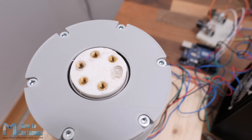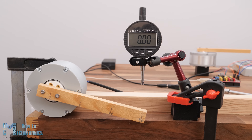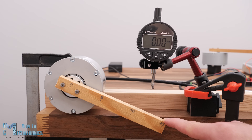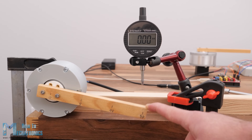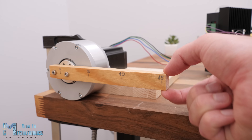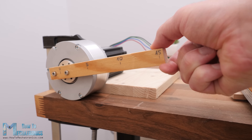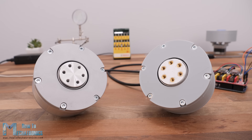I also did accuracy tests. Repeatability was good for both versions. However, once a load is applied, both drives show some backlash. The CNC machined version showed around 4 mm of play at a distance of 12 cm when force is applied in both directions, while the 3D printed version showed 7 mm of play at 15 cm. The backlash is present because the bushing dimensions were not accurate, and also because I manually sanded the disc profile since I ordered them powder coated by mistake. This also caused the backlash to be inconsistent — some shaft positions have more backlash than others. We can get better results with more accurate bushings and cycloidal discs machined with the proper clearance.